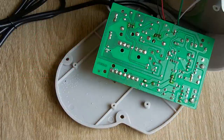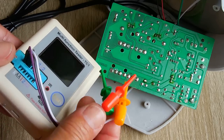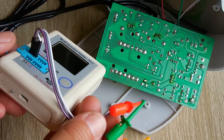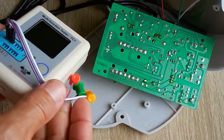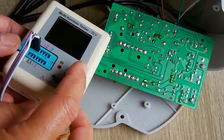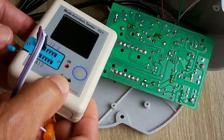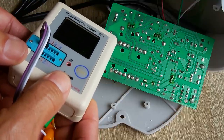The second way that you can test a transistor is using a component tester, like you see right here, one that I've used on my channel in the past several times. Very inexpensive, around $25 or $30. I have a video showing this. Take each one of these clips, connect it to each one of the leads or pins on the transistor, and then you would push this button right here to test, and it would give you a readout, NPN. It'll give you the HFE. It gives you all the specifications on the transistor. It also tests MOSFETs and many other components.